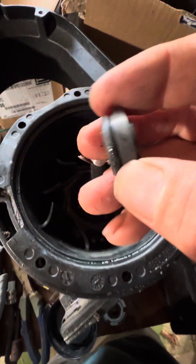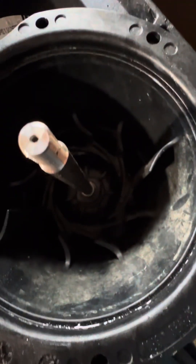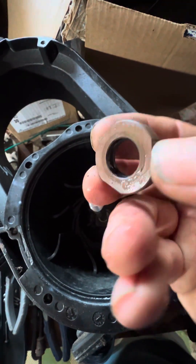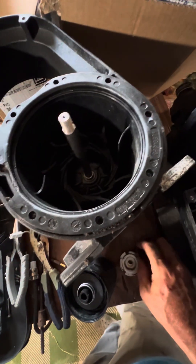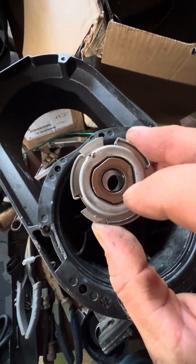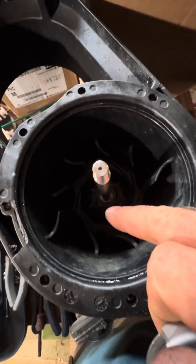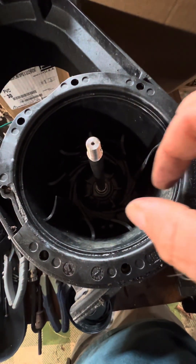I'm thinking this o-ring is bad on that situation. Basically, there's an o-ring and this fits like a key — only one way. The ceramic side goes down and fits on that, and this only fits inside of this one way — see the design. Ceramic on ceramic. Make sure that o-ring is at the bottom. It was really hard to get that out; you need a little hooked pick tool and just come straight up the shaft with it.